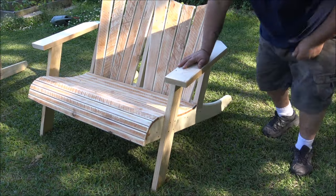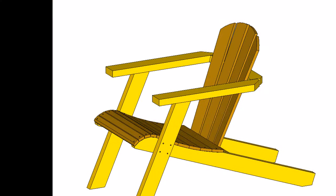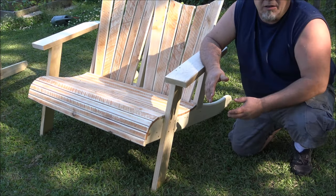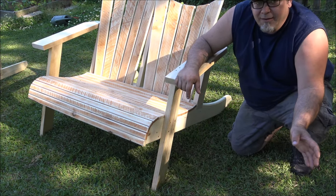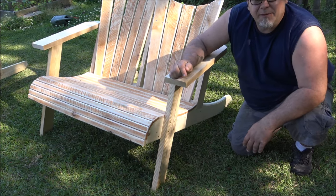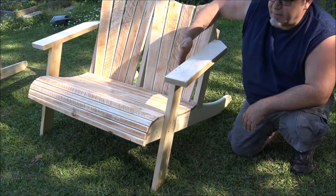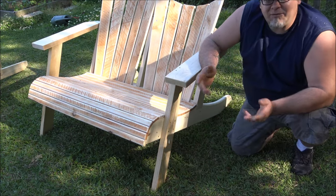Using the same material — a two-by-four — I've got a two-by-six on this one because I'm supporting some extra weight. The plan set has a one-inch-by-one-inch grid diagram showing you the pattern for a rounded face, a butt cup, and a rounded back for a more comfortable seat. A lot of guys prefer the butt cups and rounded backs, but if you get your angles right, they don't really increase comfort that much in my opinion. In the back of the plan set, there's a grid diagram showing the butt cup and also a cut for the back, if you want to add that. That one calls for two-by-fours, not two-by-sixes.